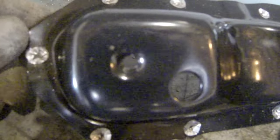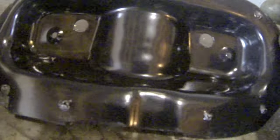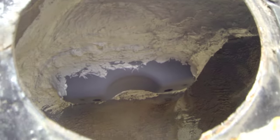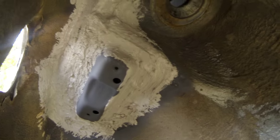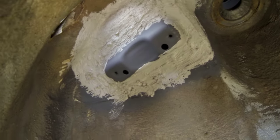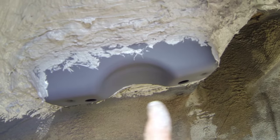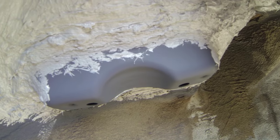As you can see we're drilling some holes because we need something to weld to - weld-through holes. These were spot welded from the factory but we're not going to get a spot welder in this area, so we drill some holes just enough to get a weld. That looks a lot better than it did before - it's all been welded on, edge primed, and then a good bit of seam sealer to keep it protected, as this area is going to get covered in everything.